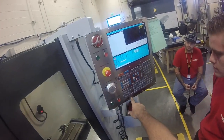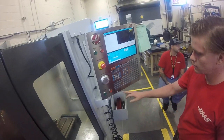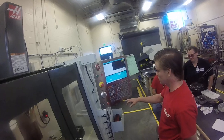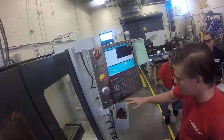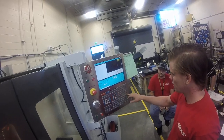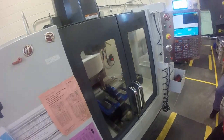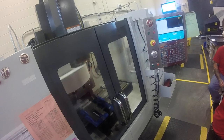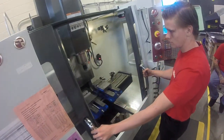I usually turn my rapids down. This is a slow running rapid machine, so 50% will be pretty good. Go to MDI — it's T9, tool nine. If you do ATC that's the quick way of changing on this machine, or we can type in T9 M6 in MDI, which pretty much works in every machine. So we got a drill chuck now.